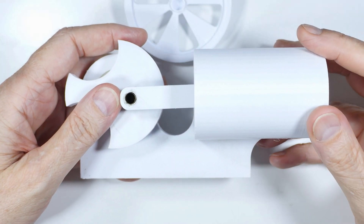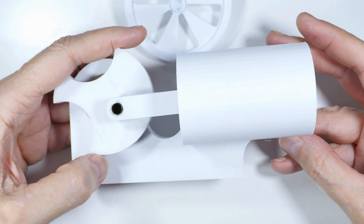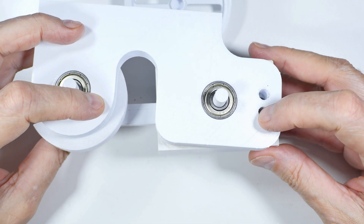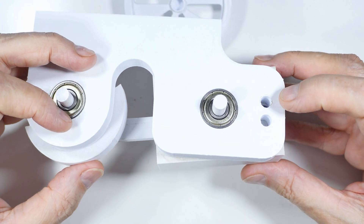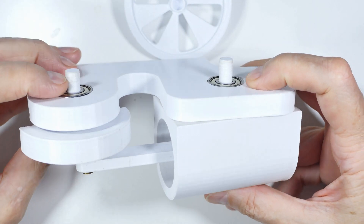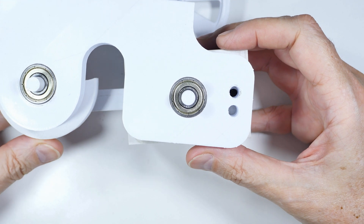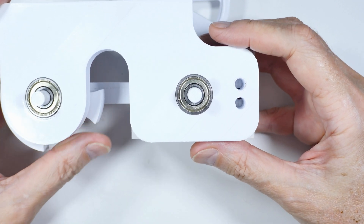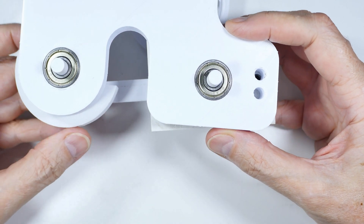One of the important things is for the cylinder to move up and down. As the crank comes around, the piston is forced to move up and down, and these holes on the back become the intake and exhaust. The wobble of the cylinder chooses whether it's time for intake or exhaust, and we can see as we turn it back and forth we can see inside the holes — it's on the lower one and now on the upper one. That is how the valving works, so there's no complex valving.